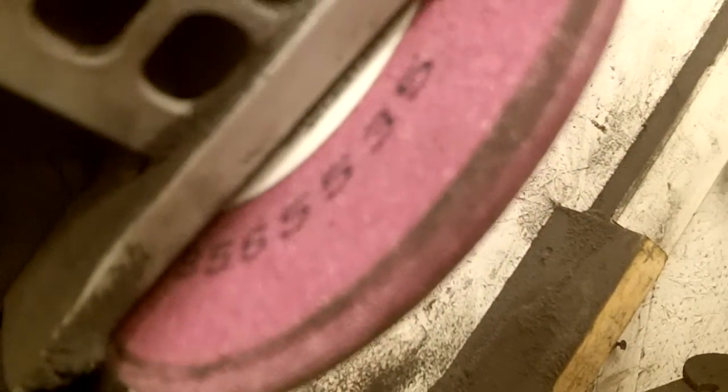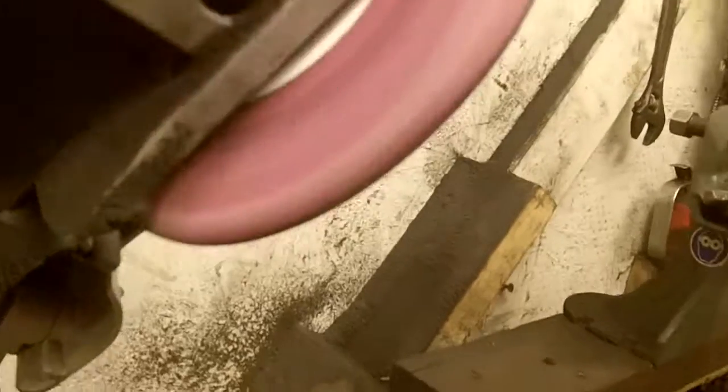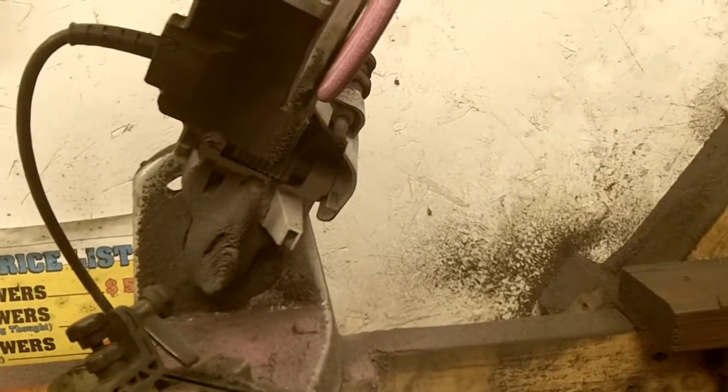Here's what I was talking about on this cutting wheel. You can see this little dirt streak. It's just from oil on the chain and dirt and whatever, particles of filing, grindings, whatever. So watch, I'll show you what I do with this. And anybody who grinds, sharpens chains, I'll just take that abrasive, clean that up, and you do that every chain or two or whatever you need to do. Some chains are real dirty, so you got to do it more often. But see how it cleaned that up? That'll take a nice clean cut. It won't heat up as bad. And I gotta remember not to be so freaking stupid and stick my thumb on an abrasive wheel.